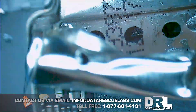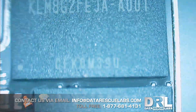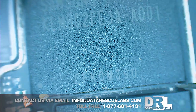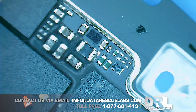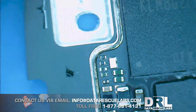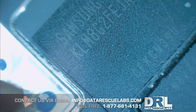You have to be very careful when rolling this back because you can damage the corners of the memory chip. Here's the shield rolled back — you can see it's a Samsung memory chip, I think it's an 8 gig depending on the model. Here's that epoxy mentioned earlier — it's super hard. On the 9930 it's sitting right underneath the chip and some of it is on the edge. You can see the epoxy is around both the CPU and the memory chip.